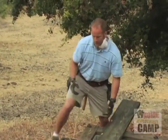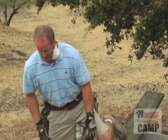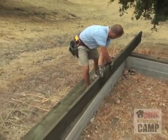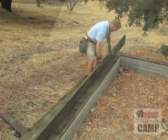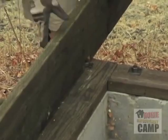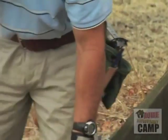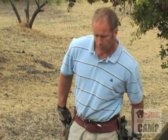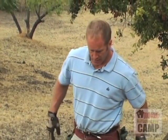And that's all you do. Slide this in place. And you see that drops right over that nut. Okay. Head down here to the rim joist. We'll nail it at the rim joist first, and then we'll toenail it down to the mudsill along the way. And from that point on, we can just go ahead and start laying in our joists on layout.